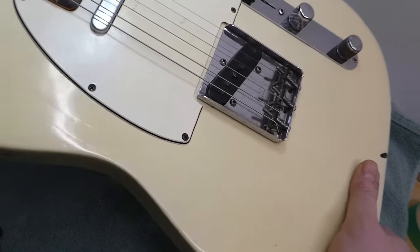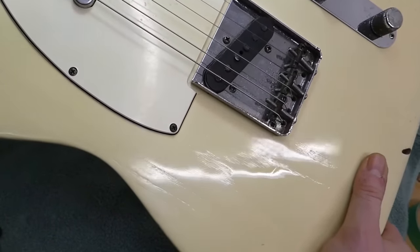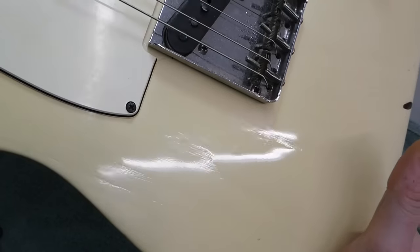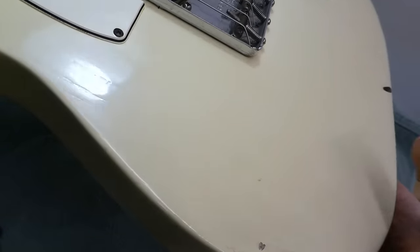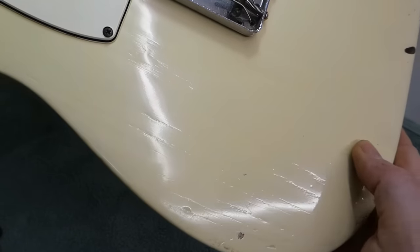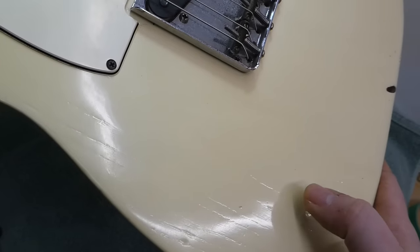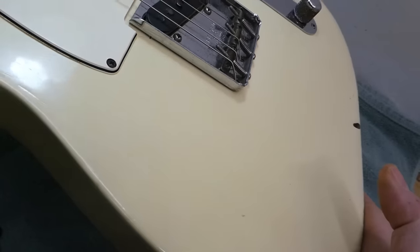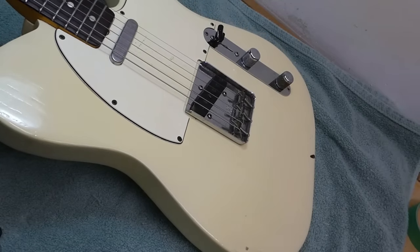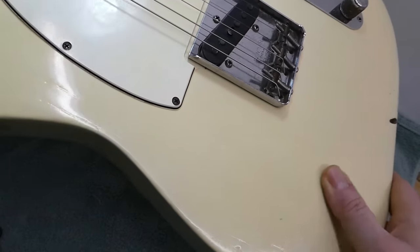This is a lovely light instrument. I'm betting it weighs around seven pounds. It's an ash body — I can tell because it was refinished at some point by someone who decided not to use pore filler. The grain in ash is very deep and it just sucks lacquer into it. It doesn't matter if you use a primer coat; eventually the top coats are going to sink down into it and you're going to see every single grain line. Up close it is almost charming, but it is obviously refinished.